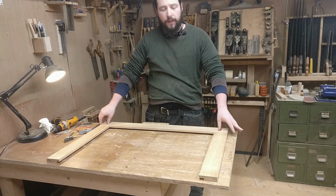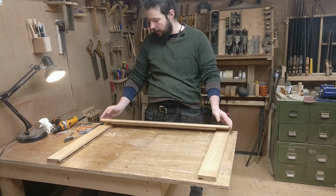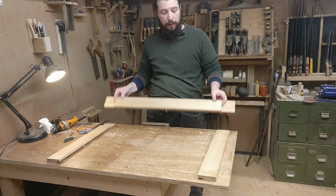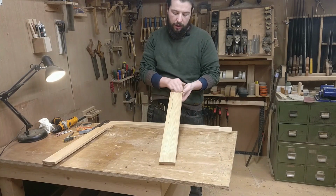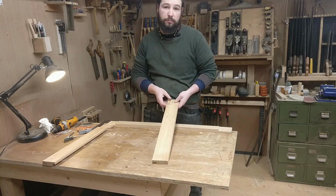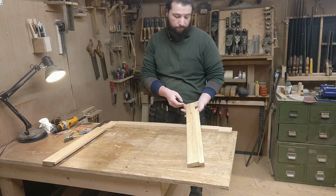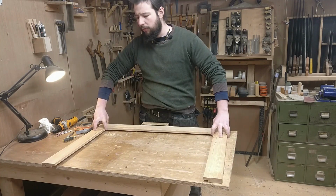Now I'm moving on to assembly of the frames and the panels. This is my back piece. So I have, you know, the lap joints there, the recesses for the panels there. Same with these guys. Recesses there, laps here, and I have that gap there because it was easier to do it that way, to be perfectly honest. There was only about a 1 mil difference between the recess and the lap, so it's just made my life so much easier. Now I've also decided